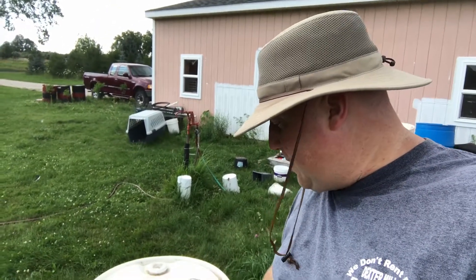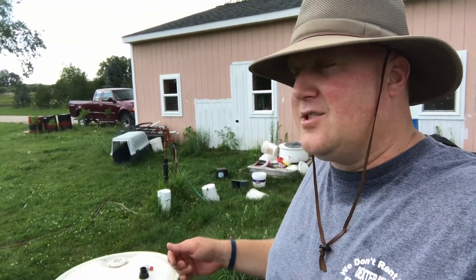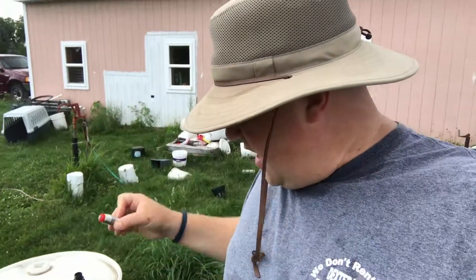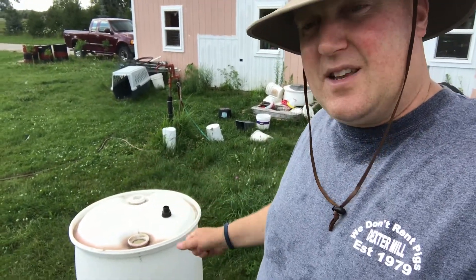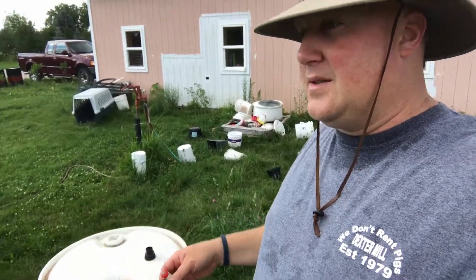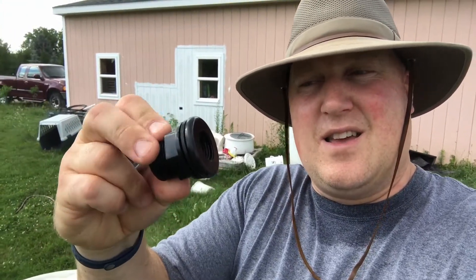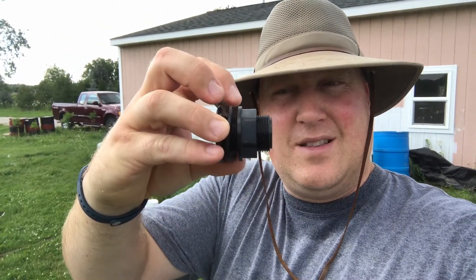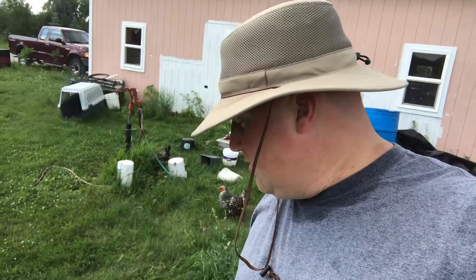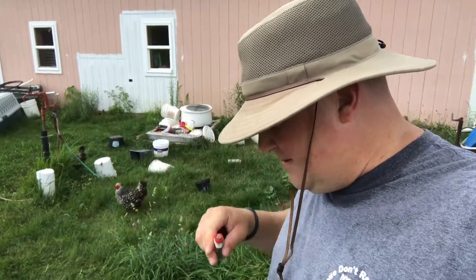You may have seen my video on making a pig waterer. I had a 65-gallon drum with the top cut off and put a hole in the bottom. I tried just screwing pig nipples directly into a hole cut in the side, but it wasn't as steady as I wanted — the plastic flexes and moves, gets loose, and leaks. So what you can do is buy a bulkhead like this. You put a hole in the side, and this washer compresses this grommet. It's threaded so the pig nipple threads right into it and you've got a firm connection.